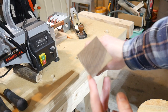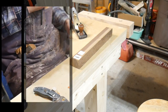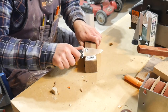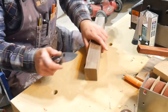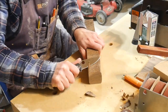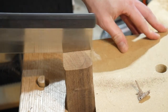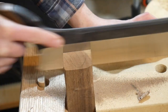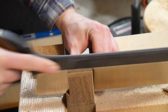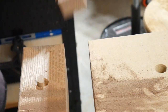I'm using this blank of 2x2 inch walnut to make this handle. The first mistake I made right off the bat: I traced the eye that the axe handle is going to have to fit into on the axe itself on the blank, and I didn't perfectly center it. When I mounted it to the lathe, the handle is slightly off-center — kind of a bummer, but not the worst thing. I started off trying to use a pocket knife to start whittling it down and that did not work very well, so I figured I'd clear out the majority of the waste using my dovetail saw. I sawed off the four edges here that aren't going to be needed. That will just save me a lot of time with the sanding.